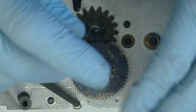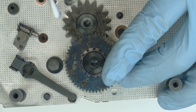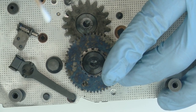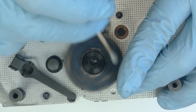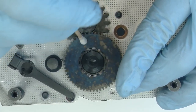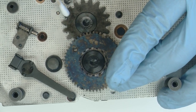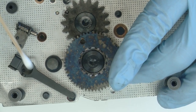The problem I was having was that this gear here — it had stopped hard so many times that this burr right there, as you would try and drive this through its limit of motion, it would slam into this gear. So I had to take a diamond file and take an edge off of that, so look for that when you're dealing with them.